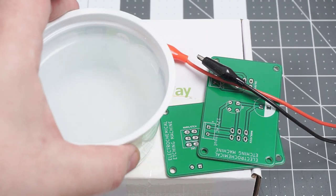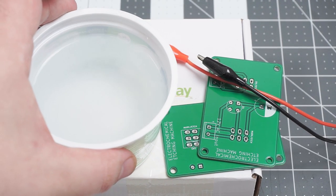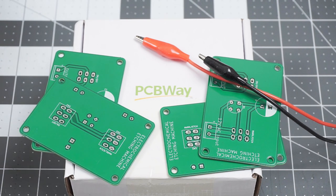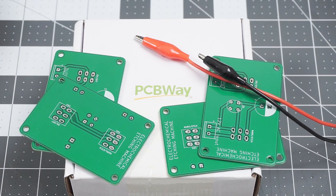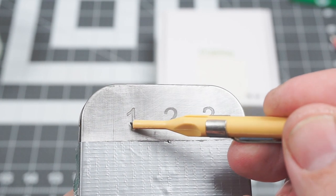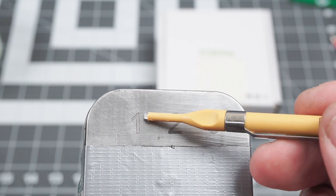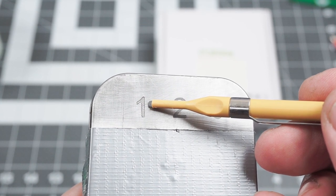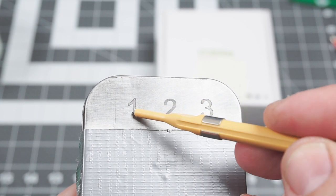If you have seen electrochemical etching machines before, you may have noticed they have two settings, DC and AC, or etching and marking. With a DC power supply, shapes can be etched on the metal part, creating a recess similar to mechanical engraving. That is permanent marking, which won't rub off. The color of the material will basically stay the same.